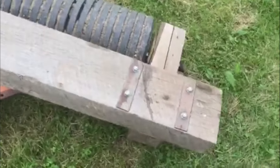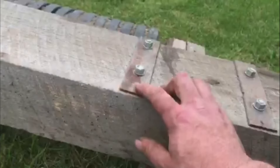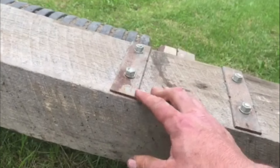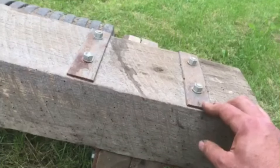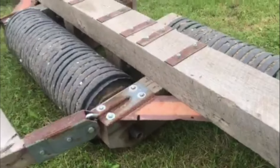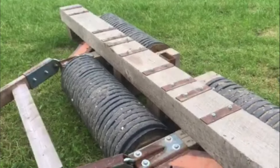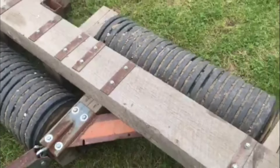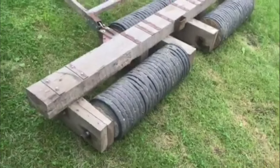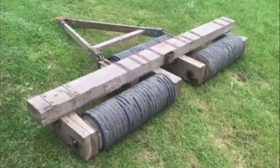Every place where I've got something joined together, I bolted it together rather than using lag screws, and I've got sandwich plates everywhere to keep the heads from sinking into the wood. So that's it — that's what I did. I'm sorry I don't have any video of actually building it, since that was before my YouTube days began.